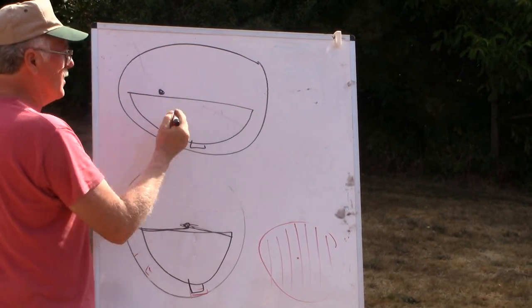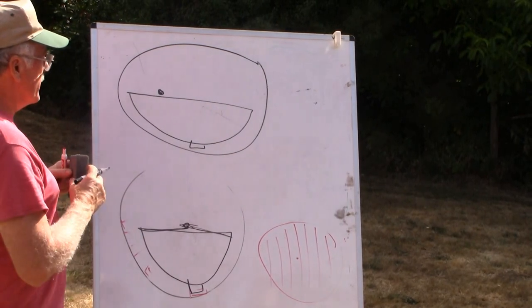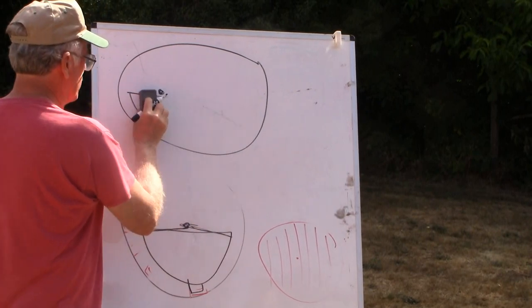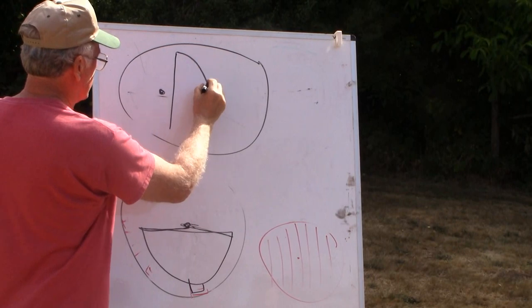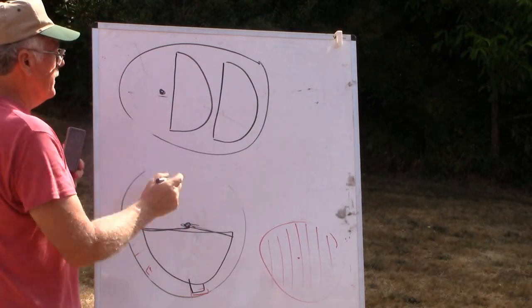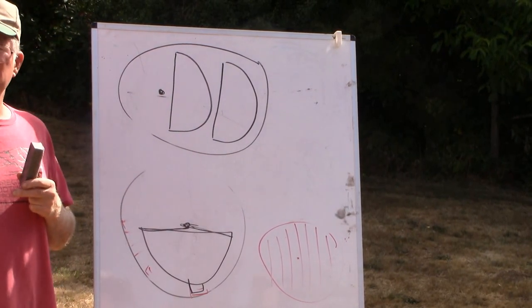And so if you want the biggest bowl, you would be tempted to take this bowl right here. That bowl is really going to warp. It's not going to be balanced. It's just not very pretty. Really, the right answer when you get a log like this is to take a bowl like this, maybe take a second bowl like this. These bowls will be balanced. They're a little bit smaller, but they'll be prettier.